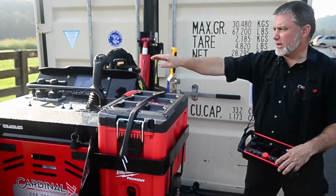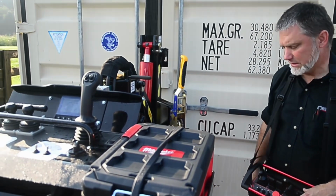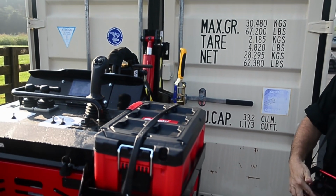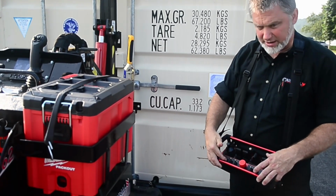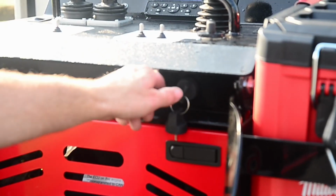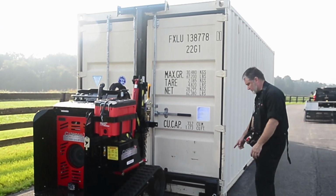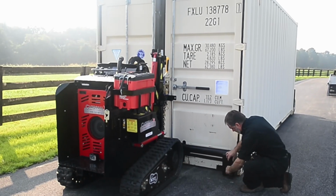Lock the fifth wheel pin to secure the mast rotation. Position the mast and track switches from float to lock before unattaching from the container. Stop the engine before releasing the mule arms. The locks are released by pulling a pin and simply turning the lock lever into horizontal position.